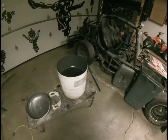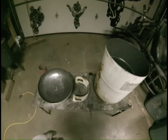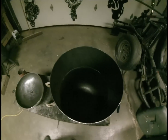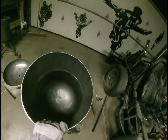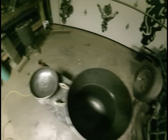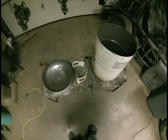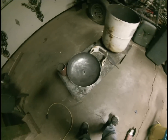I just cut the top of this tank off and took a file to all the edges so I don't get cut. I got rid of the handle — I'm not going to use it. The inside of these tanks are filthy and they stink, but I took a wire wheel on a drill and cleaned it up as best I could so my cement will stick. Now I've got a little bit of welding to do, so I'll go ahead and get my welder fired up.